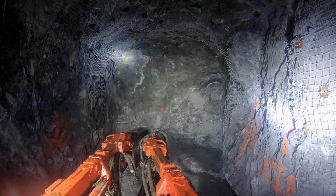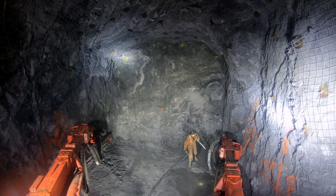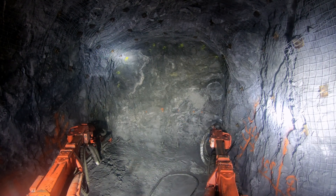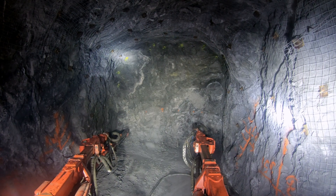I get my spotlight up — I've got my lifters done and I can see I've got a nice white straight PVC pipe here for the lifter markers. It's nice because you can load through those. With the black curled tubes, if you can't get them out and you've got water in your holes you're getting wet, whereas with PVC you can just blow them out, and if you've got emulsion you don't even have to worry about that.